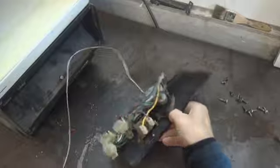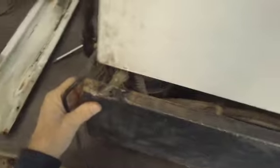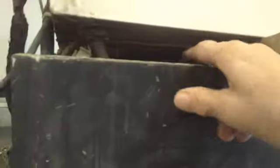Okay, so I also pulled the capillary tube out and disconnected this panel, so keep that on the side. And also, since the screws are out of the cabinet, in order to remove this cabinet, we have to disconnect the two heater loops that go up into the cabinet. You see these two pieces of copper tubing here? That's what goes around the perimeter of the door that keeps moisture from forming. It's part of the condenser, so they come out over here.